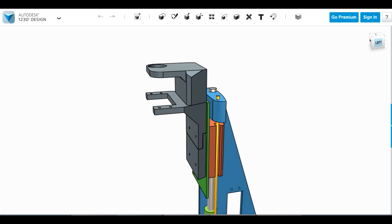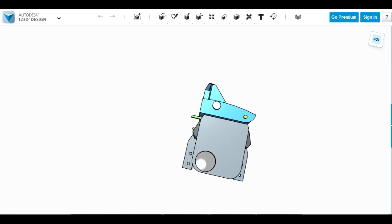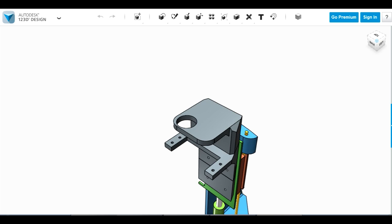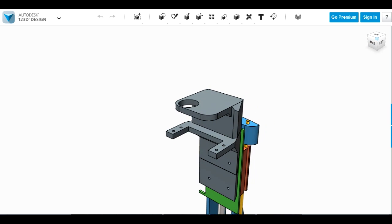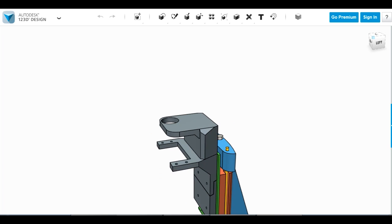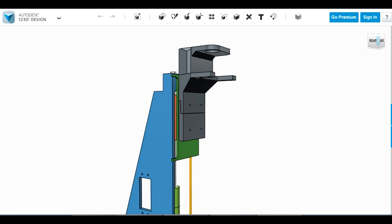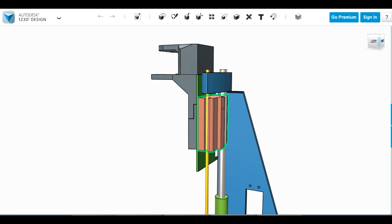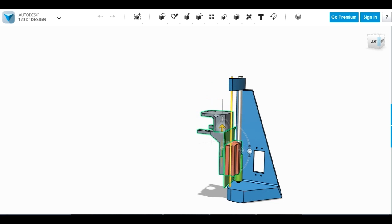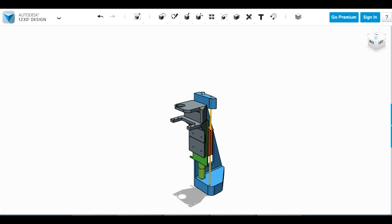Here's the next part - these gray sections I've cut into three parts so I can print them flat on the bed. The middle fork part holds a servo, and I've got a ring part suspended above it so I can shove a tube down there attached to the servo horn - that will stop the thing wobbling. If the periscope top is just attached to the servo horn there's quite a lot of wobble on the output shaft, so this ring holds that shaft straight. The periscope top sits straight on top, screwed through into the main carriage part, and the whole thing will move up and down.